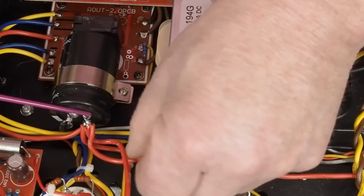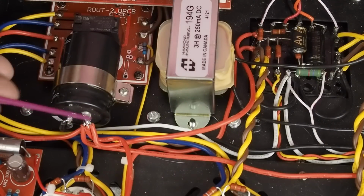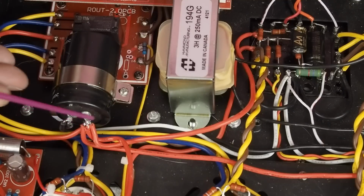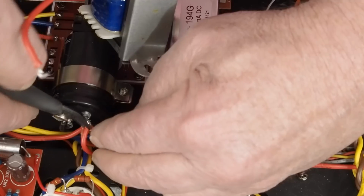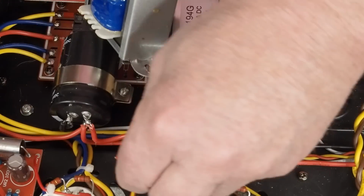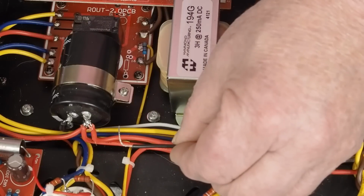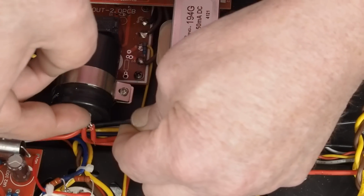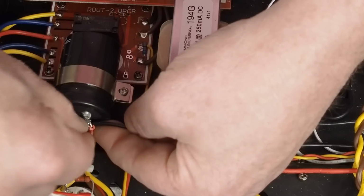And so I think it's going to be easier to just cut this wire off than trying to desolder this and end up having this just fall apart on us. And they're probably kind of all twisted together before they're soldered on there. So I think it's going to be a lot easier to just find the wire that goes to this choke and cut it off. Like that. And then have enough stripped off, kind of bend it like that so you can pull it up through here, bend it over, and wrap it around that bundle of wires.